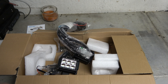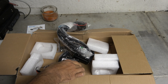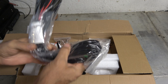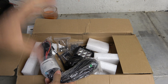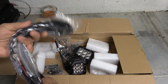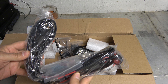For the Kubota, I'm going to tap into the headlight switch so when the headlights are on, this will be on. Same thing for the Husqvarna — hardwired to be on at all times when the headlights are on. But if you want to install this on a car — I believe this kit was made for a Jeep — you have the option of this really nice complete set. It has a relay in there, so when you turn the car off it'll power off and you get all the available voltage where you need it.